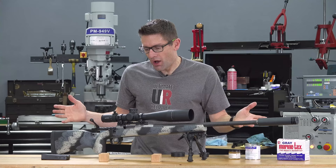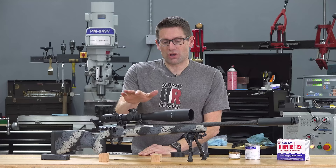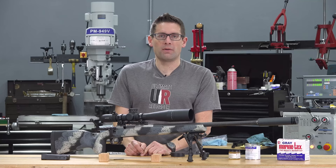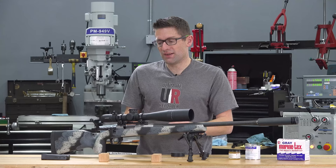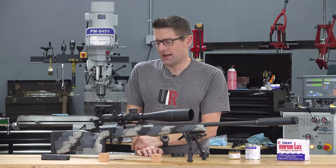The install went really well and I've had a limited amount of time to shoot with it. During the barrel break-in — another story you should check out — I used the scope at 100 yards at about 28 power for good alignment with the target spots. I did a really precise dialing in of the parallax, getting it just perfectly so that I could move my head left, right, up, and down with absolutely zero movement of the center dot compared to the target. This thing shot awesome — one of my three-shot groups between cleanings for the barrel break-in was .218, and I find this scope really easy to use.